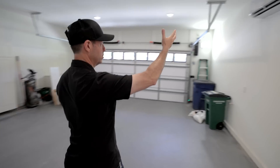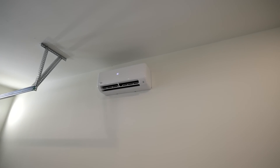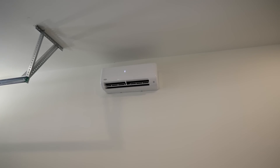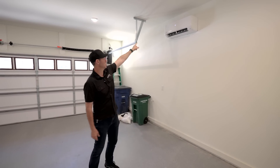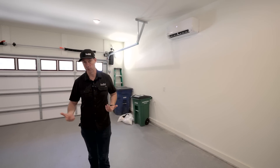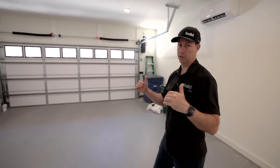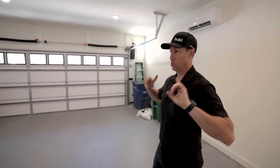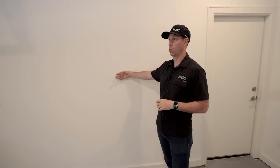I've become a big fan of putting a mini split head in the garage for not a lot of money. If you did a DIY system you could do it for around a thousand bucks; this is probably more like $2,000 to $2,500. You can see it's set to 80 degrees — it's just keeping this space tempered. So if you're going to use this as a second pantry, or store car care products, you can just keep that temperature a little bit lower. We also did the same insulation strategy in the garage as the rest of the house: T-studs with two inches of closed cell foam and then rock wool. We also did a conditioned attic space.